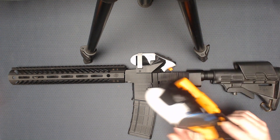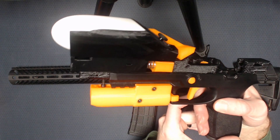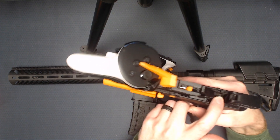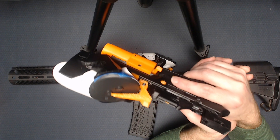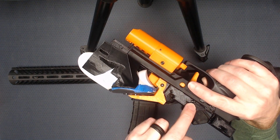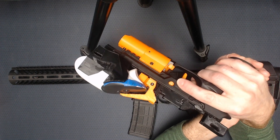As far as function updates for the XR pistol, for anybody that's been following along: I now have magazine state tracking. If you watch this button right up here — when I eject the magazine, the mag's out and the button goes down; mag goes in and the button comes up. This detects when the mag is in or out. At some point I'll end up making dummy mags, but testing with real ones for now. There's a spring underneath that provides the force upward, a connecting rod that runs to the back, and it pivots — so when the mag goes out, this comes down.